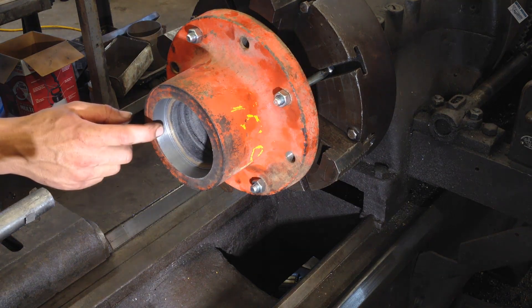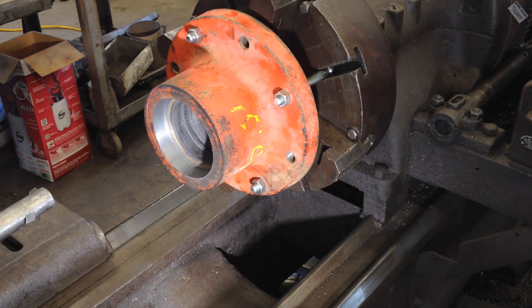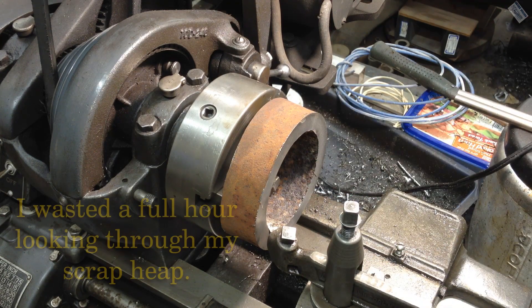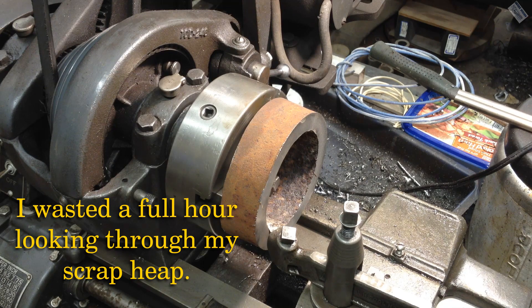I've got to put a little chamfer on there, then I'll start building the bushing to go in there. We'll do the bushing on the Atlas lathe so we don't have to take this thing out of the chuck. I couldn't find any four-inch outside diameter pipe or cold-rolled stock — I have tons of three-and-a-half and four-and-a-half, but no four. So I found this old chunk of oil well drill rig...